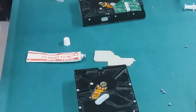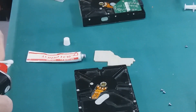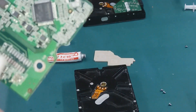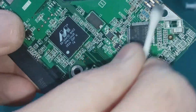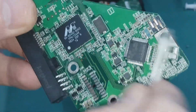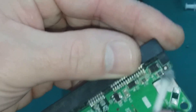Take some Zippo fluid — which is the better option, better solution — and remove this paste everywhere you went with the stick. See the stick is dirty, because it doesn't just pick up the paste you used, it also picks up the dirt that was left on the board.